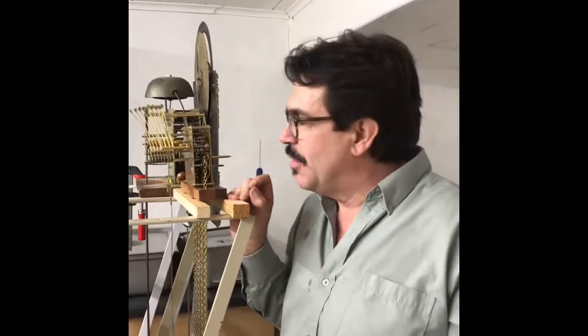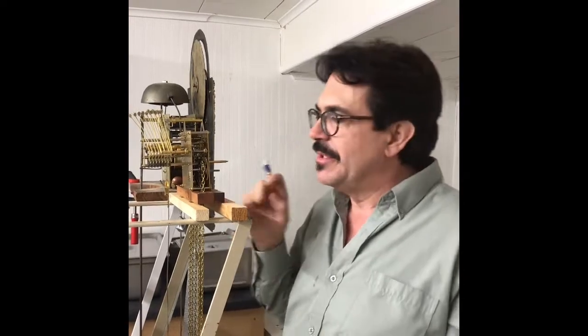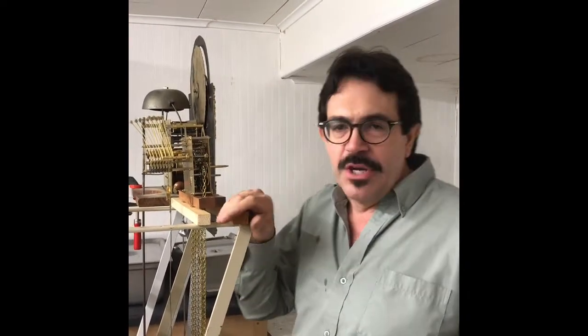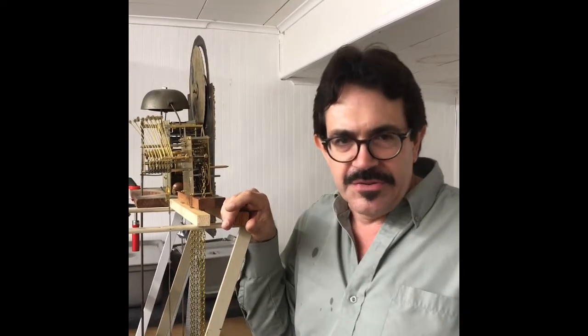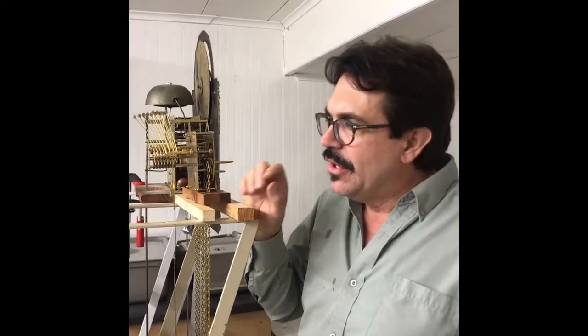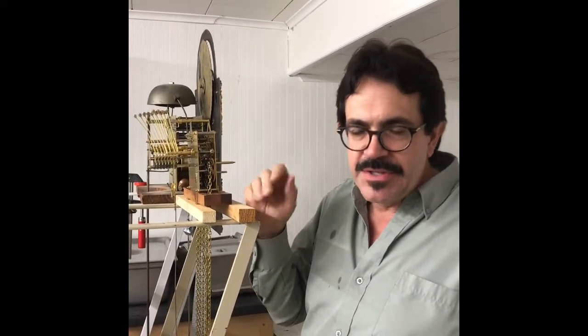And one other statement rather, don't use WD-40. We have a lot of people that phone in or call me, they use WD-40, their clocks are not working. WD-40 is a short-term lubricant. It's great for loosening nuts and other things, but the end result is when that dries, it turns into a grease, 6 months, 9 months, 10 months, and the grease is not an effective lubricant. It actually increases friction and your clock will not run.